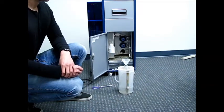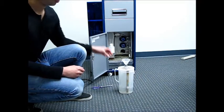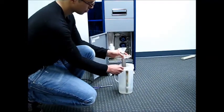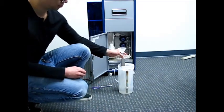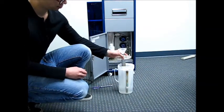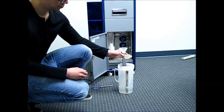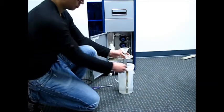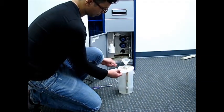After so many minutes of the water pump and compound pump running, it will come up and tell you to exchange the water filter or first filter. That's the white cloth filter inside that pitcher. When you look in there, you'll see that it's about 2/3 to 3/4 full of what I call cottage cheese. And you'll throw out that white filter and install a new white filter. And then also you're going to want to clean the tubes. And that's what that black bottle brush is for, to help you clean those tubes. And then you'll obviously refill with water as we just did.